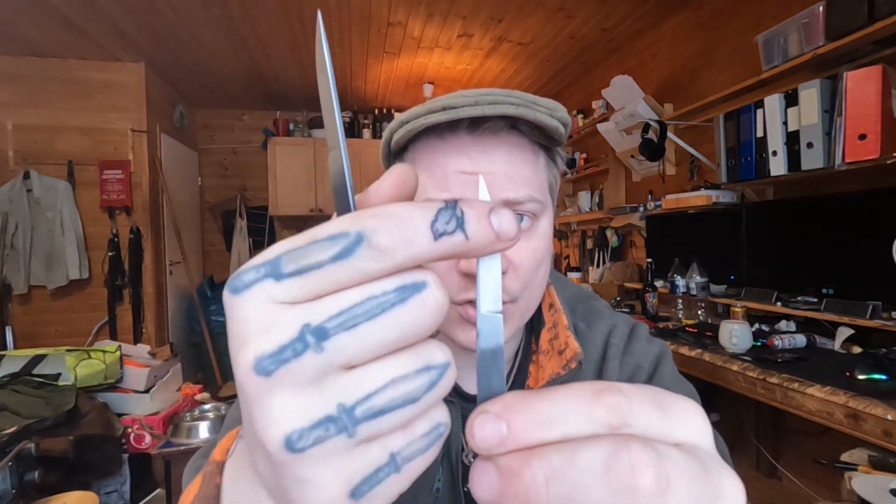And having that extra metal there on the V3s has substantially impacted the ease with which the grinding applies. It is so much easier to grind the V3s, and there's large variations in the V2s when it comes to grinding the bevels. You see this one's been overground and just lost a bunch of metal from the tip. So these were very difficult to grind, and I'm freehanding all of these. So there had to be that change. There had to be that shift into the V3.